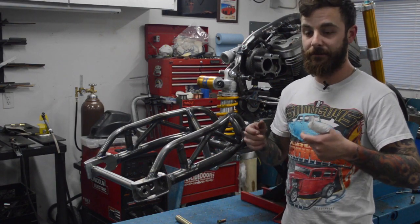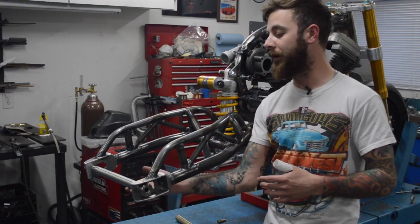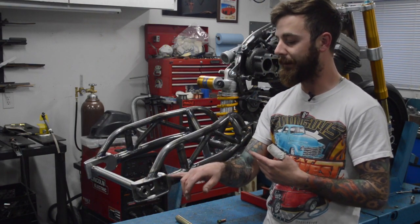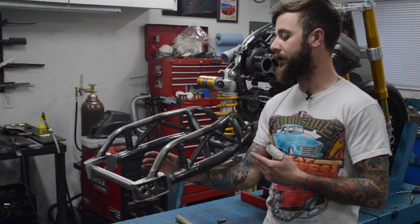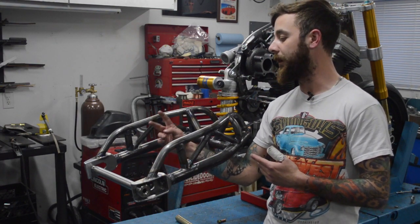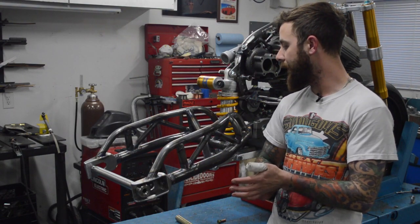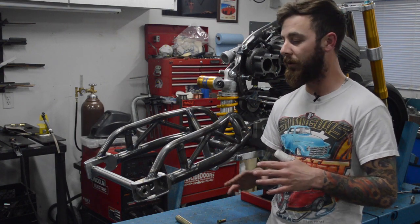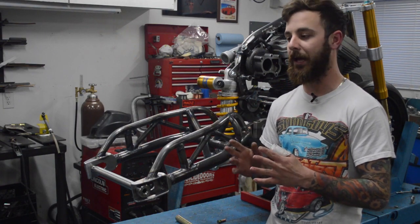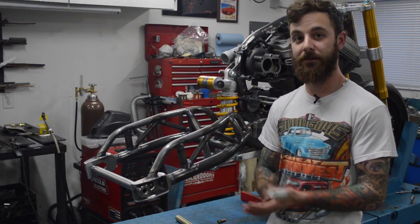Put the rear wheel on it — not too stiff, not too soft, it works good. I'm happy with that. I've already made a rear axle. Next episode we're going to make the adjuster plates, make those spacers, drill a hole in the swing arm for a brake stay, make the rear brake caliper mount, get the chain fitted — all of that. Then this thing will be bolted on as a roller with brakes front and back. Front end I already have the brake rotors and calipers, and they'll just bolt on. She's pretty close to being a roller — we can move on. Next time.